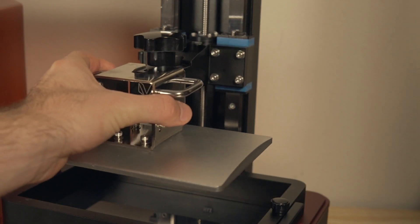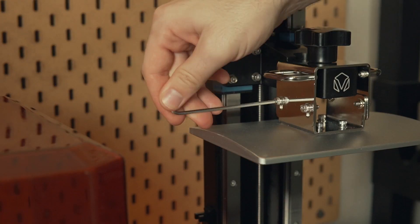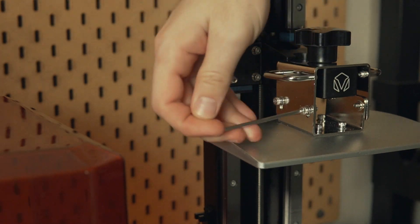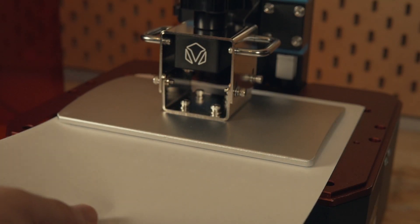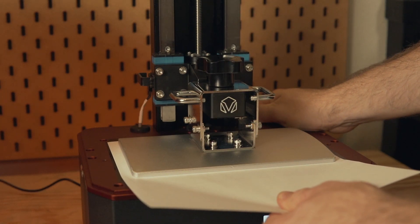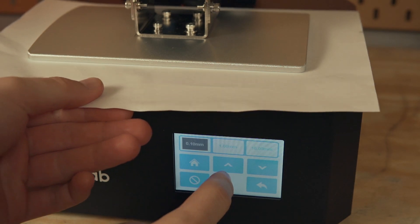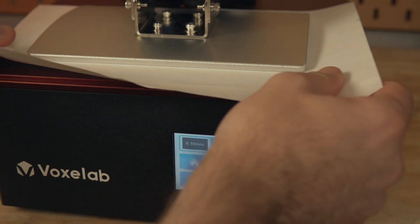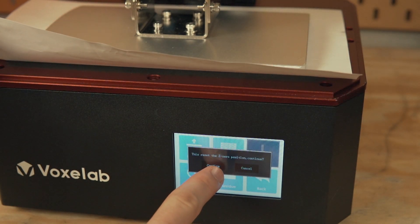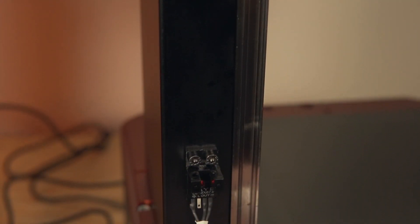Like most other resin printers, setup is quite simple and involves attaching the build plate, loosening the build screws, and then homing the build plate so you can tighten those screws and make sure the build plate is flat against the LCD screen. This is the first resin 3D printer I can recall where even having the build plate as loose and far away from the LCD screen as possible it was still too tight, so the solution was to manually jog the build plate using the menu and set zero via the firmware. For those who prefer it, I do think it shouldn't be too difficult to physically adjust the end stop to trigger a bit sooner if you don't want to set zero via firmware.